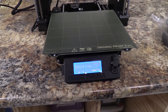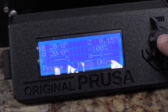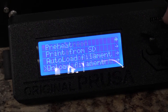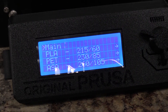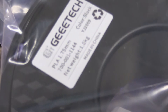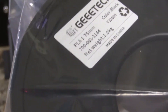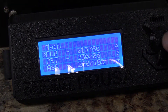The printer is going to boot up, and to get into the menus we're going to want to push in on the control button, and then we can scroll into our different settings. So today we're going to do unload filament as step one — push the button. We're going to select what type of filament is in the printer. On your typical roll of filament there's going to be a sticker, and this one says PLA, which is the same as what's on the printer now. So looking at the roll on the printer it says PLA, so we're going to scroll down to that and push in on the button.